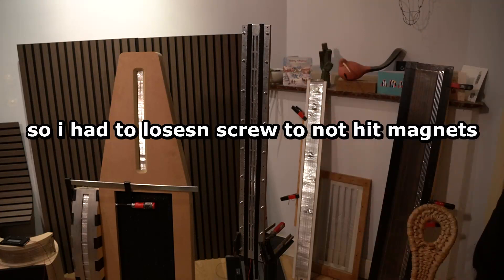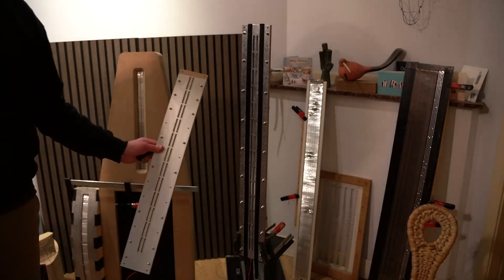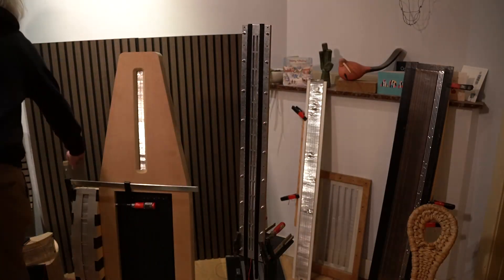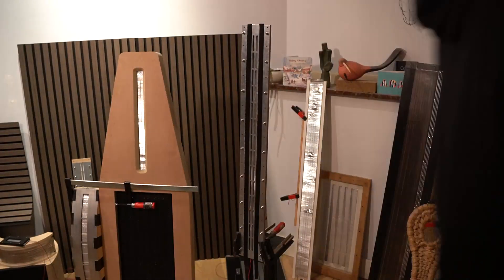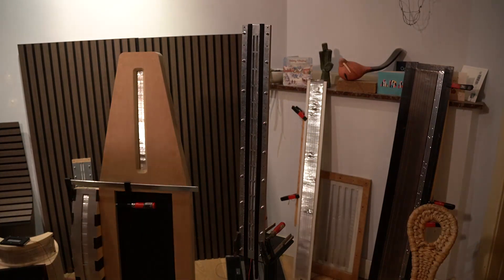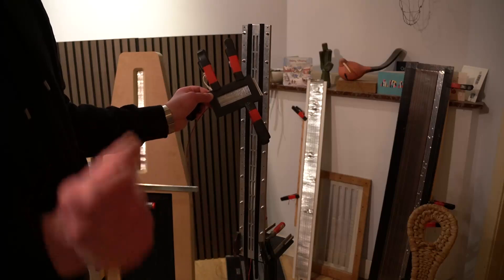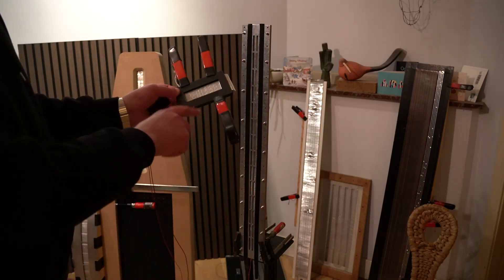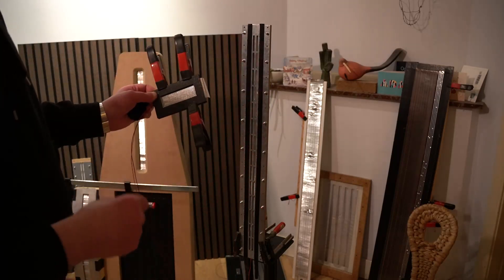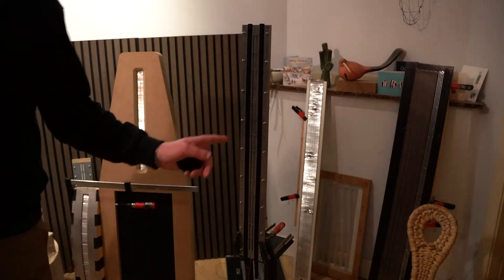I've made such a panel before and it's actually here, and it's not hitting the magnets all over the place. So I think this profile is not nice. Also, in this tweeter I have a D profile — it looks like the P but it's wider, so it's easily compressible — but it created a weird huge dip at the upper frequencies and then went back to normal. And this one is doing exactly the same.